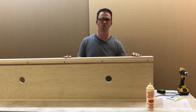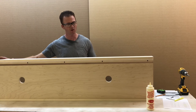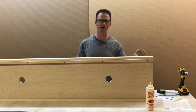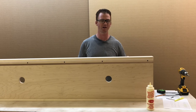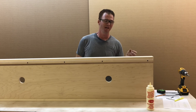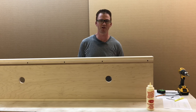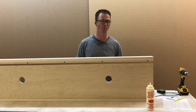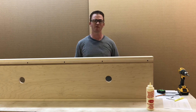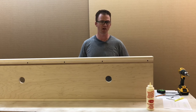If you're using a stain, sometimes it's better to use a finishing putty between your coats of lacquer to fill any small nail holes. They do make sandable stainable putty — if you use that on raw wood make sure you sand all the residue off completely or it won't take very well. Even though it's stainable, sometimes it will be a slightly different color because it won't absorb the stain the same as natural wood. Minwax makes a whole line of finishing putty, and if they don't have one for your specific stain you can mix two colors together and it works very well. If you have any questions give me a call at 501-753-9699, or to order our pre-cut kit go to our website wwbeds.com.